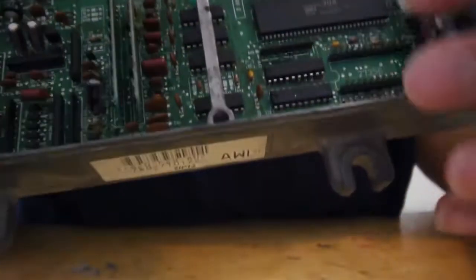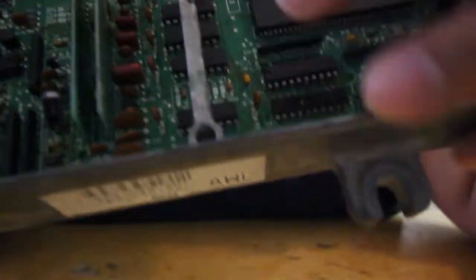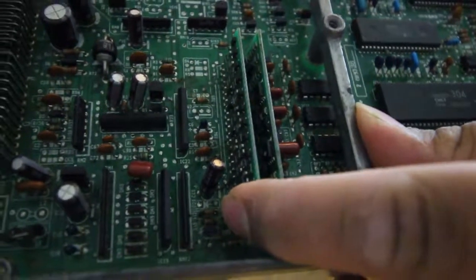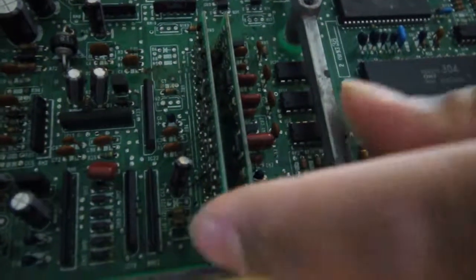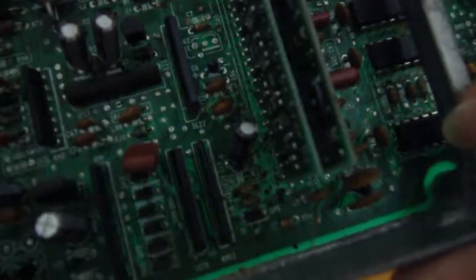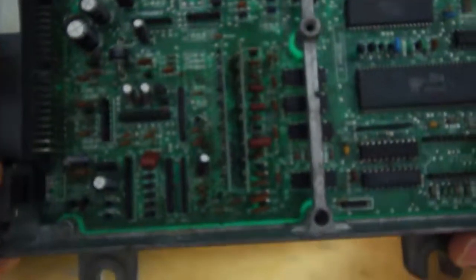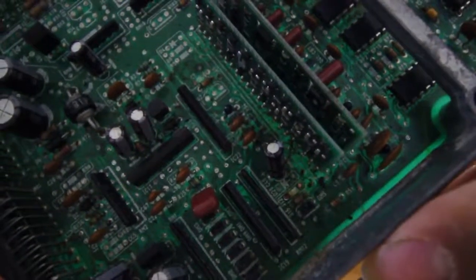Okay, I already soldered the 4 pin. I don't know if I told you, I already soldered the 4 data log pin. Now you have to desolder J12, I'm sorry, not J2. It's right on top, right next to the capacitor. It's a little one. You'll see it right there. You have to desolder it, and just remove it and leave it open. So I'm going to go ahead and do that now. Alright, so I got that J12 out. See, it's already gone. It's right there. You see my hand through the back?